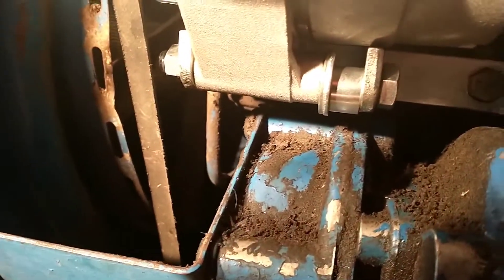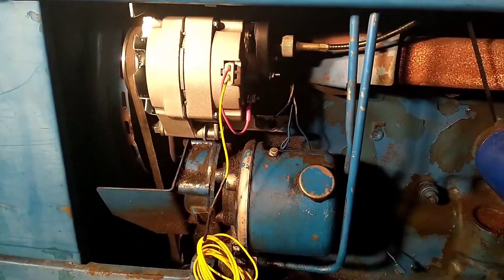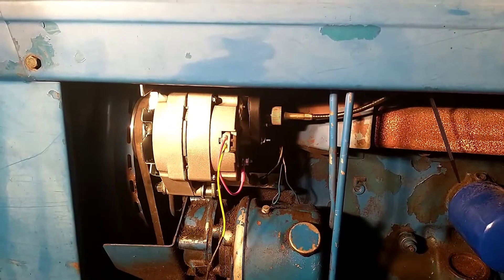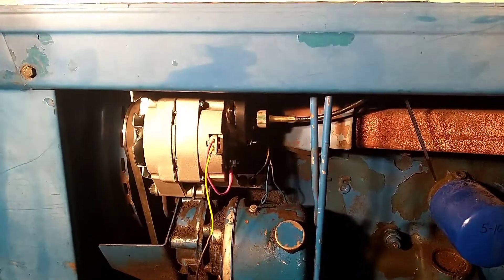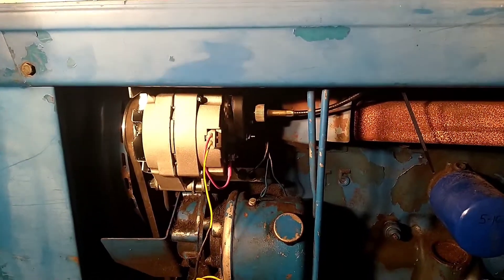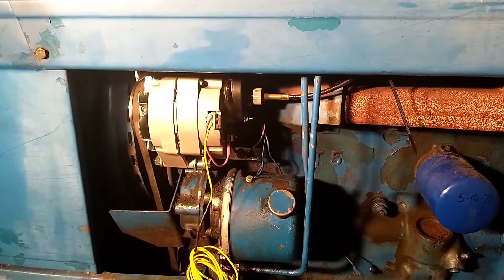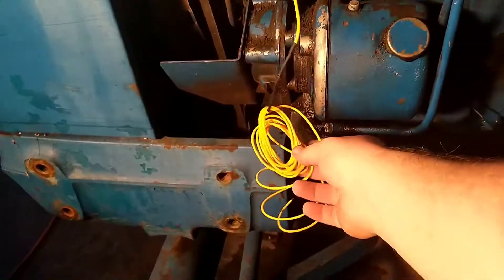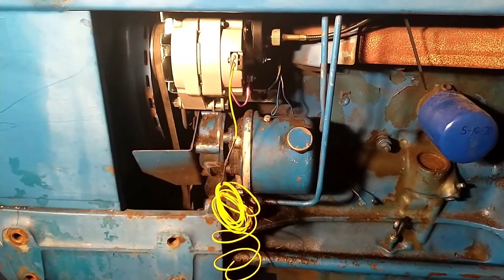The other issue I had is that nut and bolt is pretty close to the belt and there's no way to run that bolt the other way from the front, so we're just going to run it and see how it goes. With the top adjusting bracket, I assume just because on this model the gas engine is so similar to the diesel that the instructions didn't quite cover it very well. This kit covers from a 2000 Ford to a 7000 Ford — there's a lot of variations in there, so the kit's fine, it worked out okay, but for this particular tractor the instructions didn't quite follow for a couple reasons. One being that bracket, and the other it just mentions a black wire coming off the alternator — well, that wire's not black, so the only one that's in the supplied harness is what they gave me.